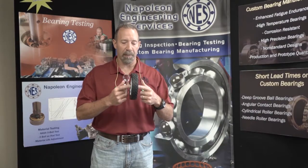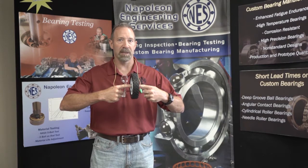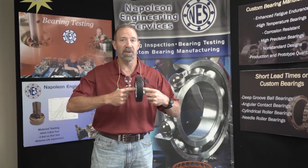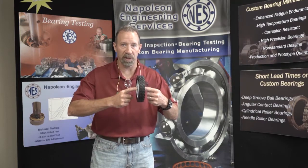One thing with respect to the bearings is you have to locate or hold this bearing to your shaft. The amount of force that you apply — as I am with my fingers against the bearing — is a load that the bearing has to support and handle. The greater that load, the more power loss there is and the more it takes to turn the wheel.